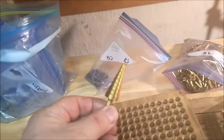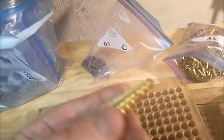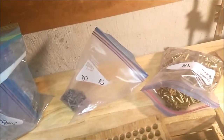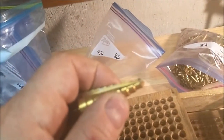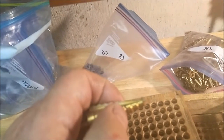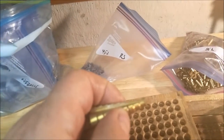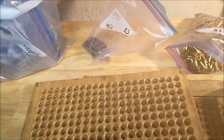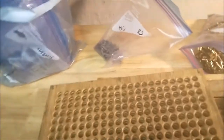Here's the way I did it. The top is a 3/4 inch piece of ply, and I drilled the hole with a step drill. Now the thing is, where these steps are, let's see, I can't remember, but it's right here. It starts to angle out to the next step, and right at the top of that angle is where I stopped them. It gives it that little bit of angle, a little cone right at the top, and you need that. It worked out really well.